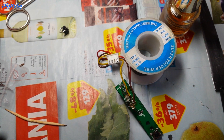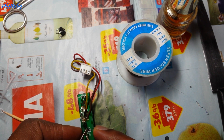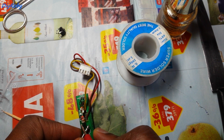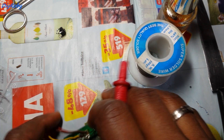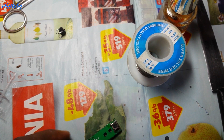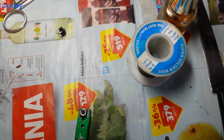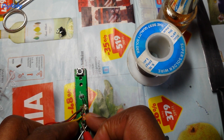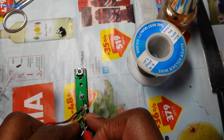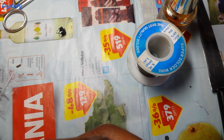Now I've put my multimeter to diode mode and I'm going to use it to see if those LED lights are still working — and you can see they are. Since an LED is a diode, once you use diode mode it's going to light up. That means I don't need to remove those LED bulbs. These are the bulbs that illuminate at night to show the name of the person you want to ring the bell to.